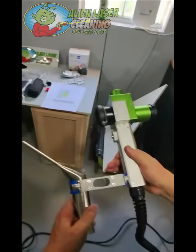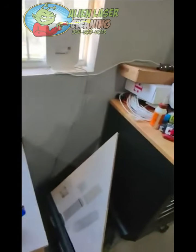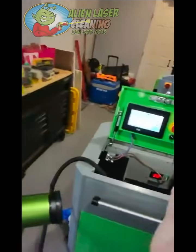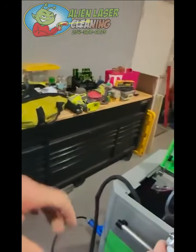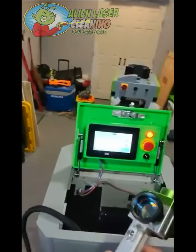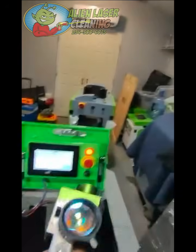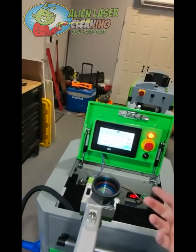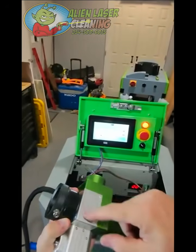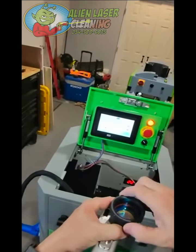The actual wand connects right here, so as you're cleaning it vacuums it up. Now this is a light duty machine, so usually you will use it for wood, aluminum, paint removal, stain removal, stuff like that. You can use it on rust absolutely, but this is for light duty. You can see right here in these holes is where the air comes out. Now we've redesigned it because the old design made it a little difficult to change the safety lens. We've made it now to where you just have to hold onto it.